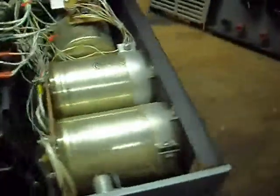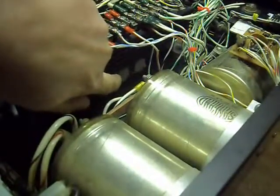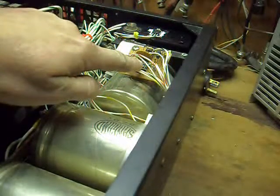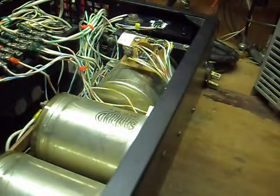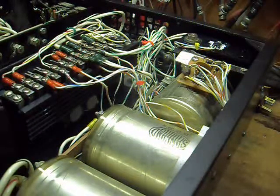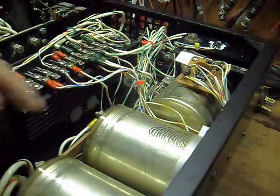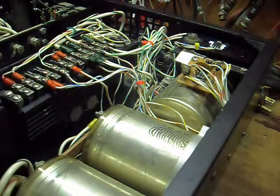And I rebuilt the unit using TO3 silicon based transistors and a newer IC based voltage control circuit to produce a power supply that would put out about 20 amps at 24 volts, and the current output is tapered down at 0 volts to limit the power dissipation of the series regulators, which is what the TO3 transistors are,